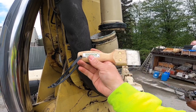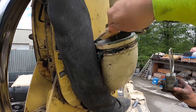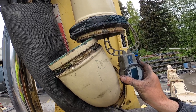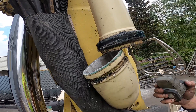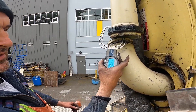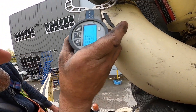Before we put this back together I'm gonna use my fancy carbide tip Goodson super scraper here, featured in one of my previous videos — awesome for stuff like this. This hogs that right off of there. 3.2. Yeah, there's not too much build-up in that pipe actually. 3.4 over here — this is going to be the nasty one on this side. I had a 2.9. Really put some pressure on that — let's dig it right through any kind of cream that's in there, make sure we're getting a good true measurement.